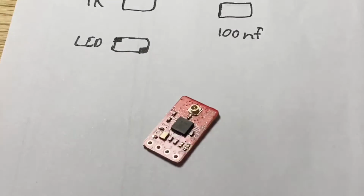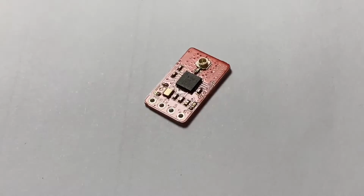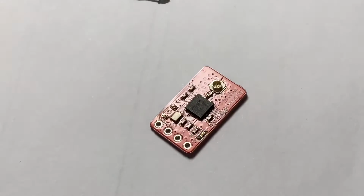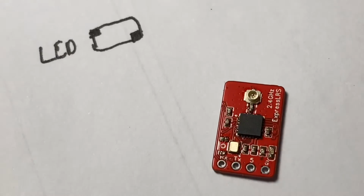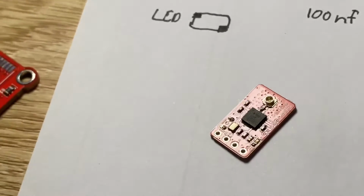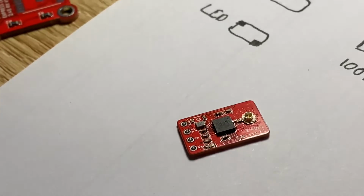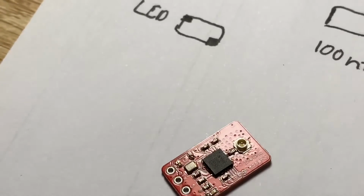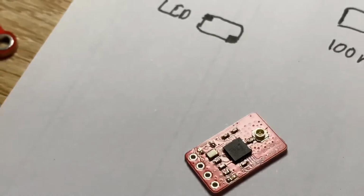All right, we're all out of the oven, and there's a few things to touch up, but generally things are in the right place. I'm not sure if that LED pad is connected on this side. It looks like it's not. The 1280 needs a bit of work with the iron. There's a few pads that are bridged there. The crystal is definitely connected, but it is slightly tombstoned on one side, but it's not too bad. Just lifted on this side a little bit. And I'm a bit skeptical on one of the grounds on this side on the RF filter, but we'll touch things up with some flux and the iron and see how we go.